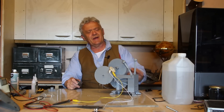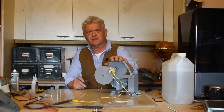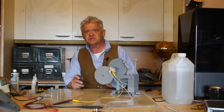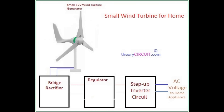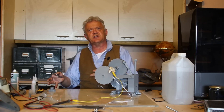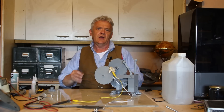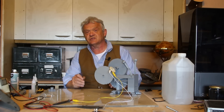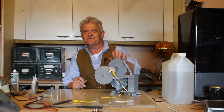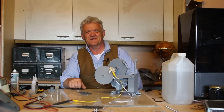I'm actually making a change to a Singer sewing machine so it can become powerful enough to charge a phone. But it doesn't matter whether it's something like this, a wind turbine, a wave machine, or a pedal bicycle — the process is the same. The two wires that come out go through a rectifier, then a voltage regulator, and after that you can use them straight away. You could connect them directly to your phone or straight to a battery. I've been asked this a number of times so I thought I'd dedicate a video to it. Hope you enjoyed it and found it helpful — please like and subscribe.